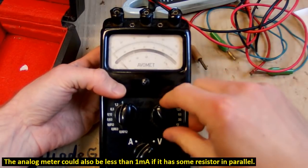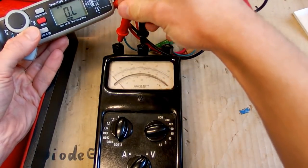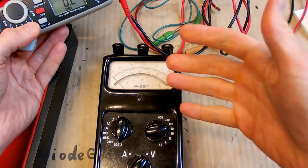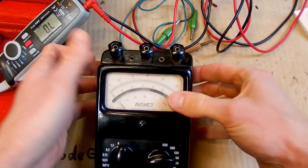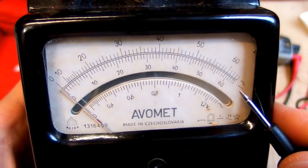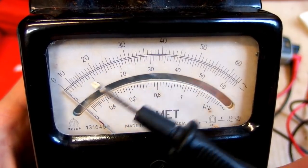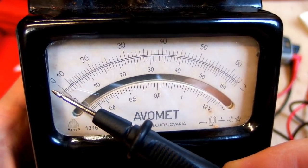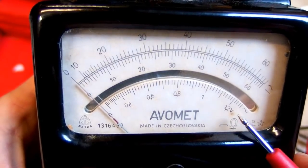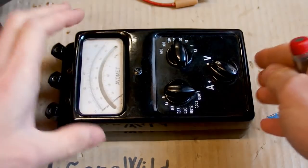So it seems like it's not open circuit — the voltage range switch seems to work but the analog meter doesn't show anything. The current meter input shows 5 or 6 megaohms, but a current meter should have very low resistance so it doesn't drop much voltage. So this one is probably open circuit — it probably has a blown fuse or blown shunt resistor. The analog meter has a double scale for DC and AC, and the DC scale is compressed at the beginning, probably to compensate for a diode or rectifier voltage drop. There is also a scale for low AC voltages, also compressed.